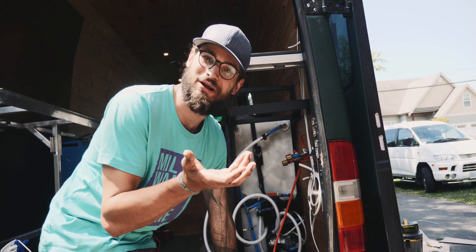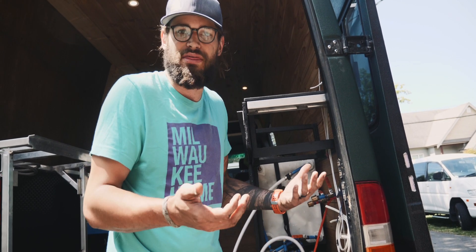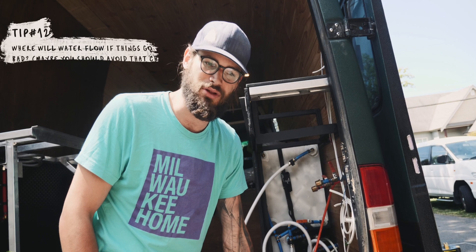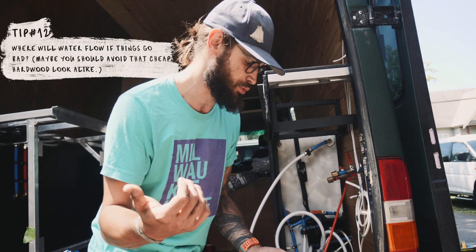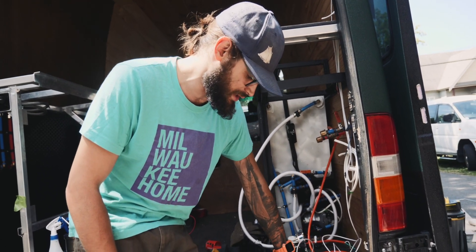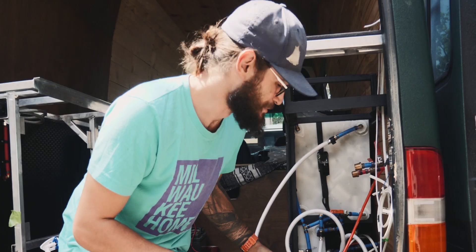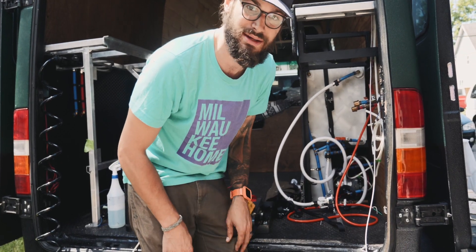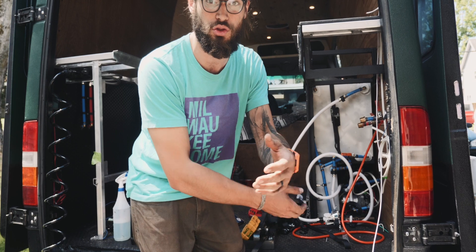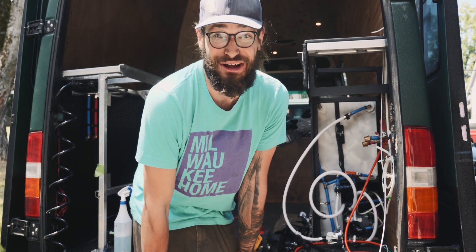The last thought: choose your flooring in consideration of your water system. Accidents happen — water can crack open and get everywhere if things freeze. Consider how your flooring will respond to 20 gallons of water and where its fastest exit point is. We put a rubber flooring product in our van and sealed it around the metal edge with sealant, so if we get a leak we can put the front wheels up on a curb and all the water will come out the back. Avoid cheap fake hardwood — a lot of people have had to pull it out after water issues.